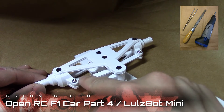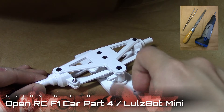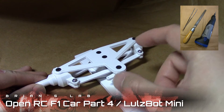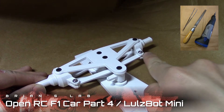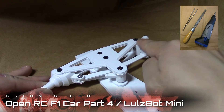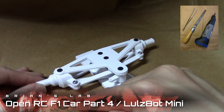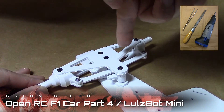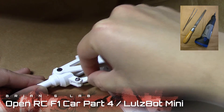It's because I had so much friction due to the burrs and lips that were created from sloppy printing that it wouldn't move at all. So I had to use the Dremel tool sideways to shave off and make sure these steering push pins were flat wherever they made contact with the wheel hubs. I also made sure that the top part of these wheel hubs were perfectly smooth so there was no friction there, and I used the Dremel tool to enlarge all the hole diameters so that the screws and everything else could move freely.